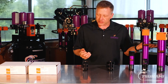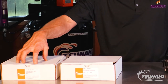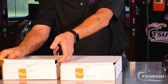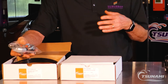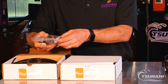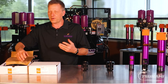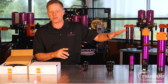That can be accomplished in one of two ways. We have a pneumatic drain installation kit available, our part number 21999-0317. It comes complete with the drain tubing, mounting brackets for various applications in our pneumatic drain line, and all the push connect fittings and drain tubing everything you're going to need to pull from an intermittent pilot source like an air cylinder that's nearby to the filter.